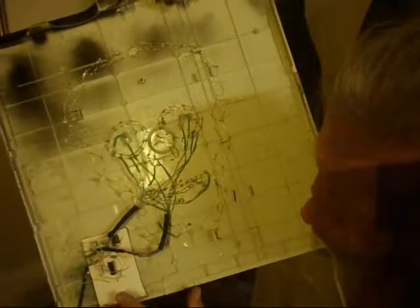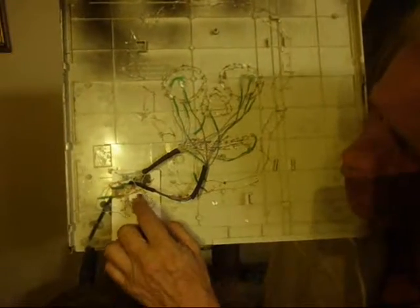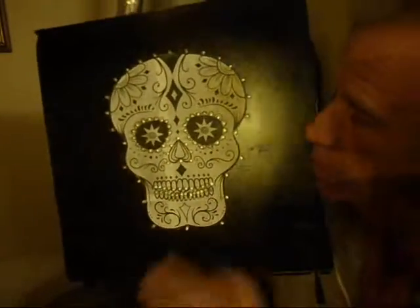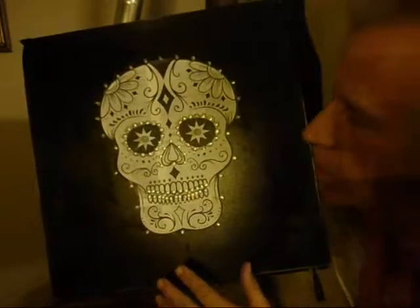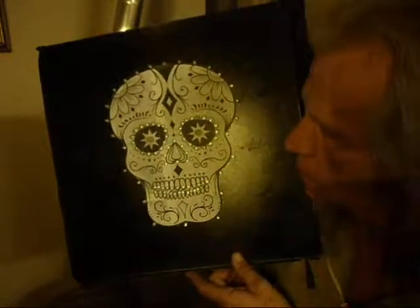It all comes in here. This board is a hand-etched board on the back side, which is always nice. We are using, for this 4017 with 555, a 12-volt, 1-amp DC power adapter. This thing is really cool — it really gets it on. People like it for parties and entertainment for this time of year.